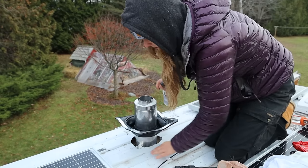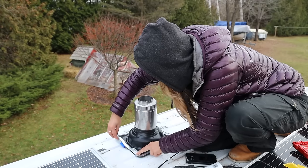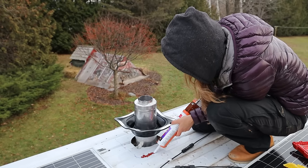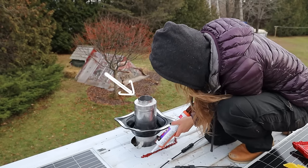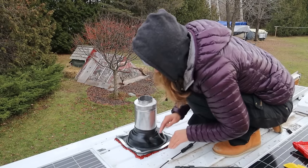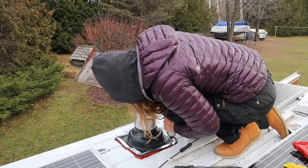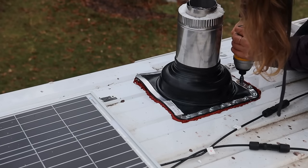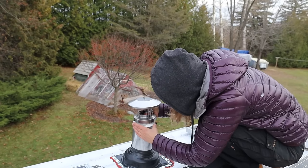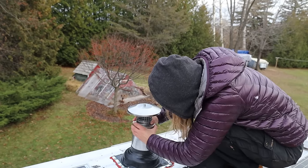I'm going to make sure that this is all very clean so that the sealant sticks well. This rubber boot has a metal trim that molds with the contour of your roof. According to Cubic Mini's instructions, the five-inch insulated flue pipe should sit about an inch and a half beneath the three-inch flue. Now I'm just taking a bunch of self-tappers. Now that the boot is sealed, this is the last piece to go on — it comes with the hardware that you need. Look at that!